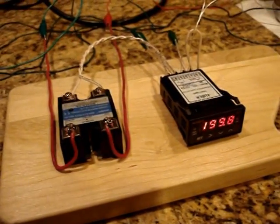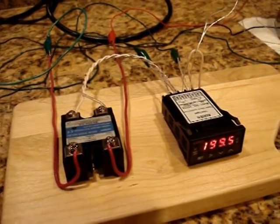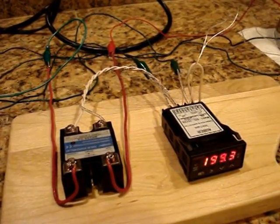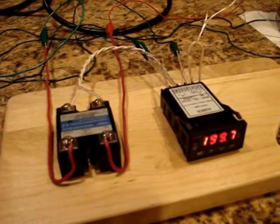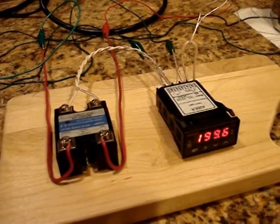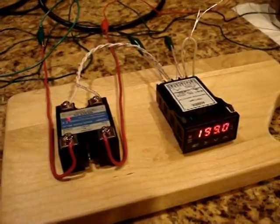And the best way to think about a PID controller is with a thermostat. When it's too cold, it turns the heating element on, and then of course a lot of heat is injected into the system, and it goes flying past the temperature you want, and then when it gets too hot it turns it off and it comes flying back past. So the analogy is like a car with an accelerator pedal that's either completely on, floored, or completely off, no gas. And imagine that you're trying to control the car at 60 miles an hour by either jamming the accelerator to the floor or taking your foot completely off the accelerator.